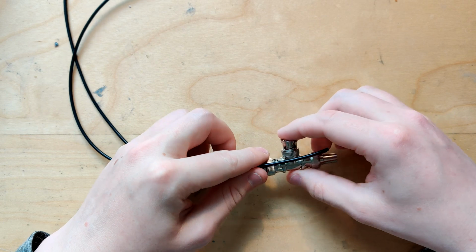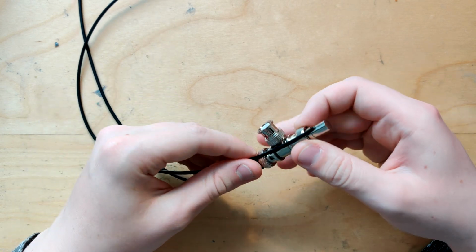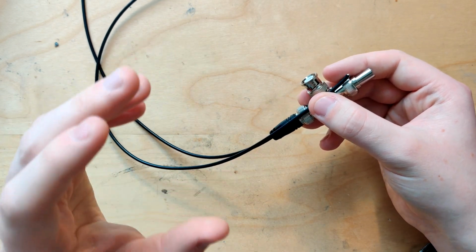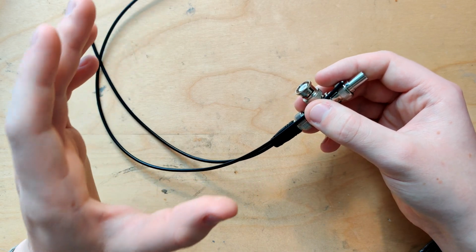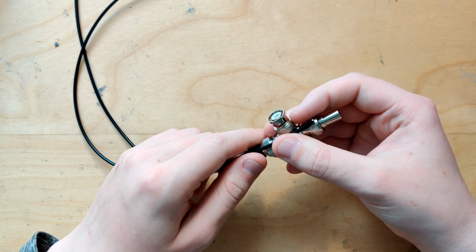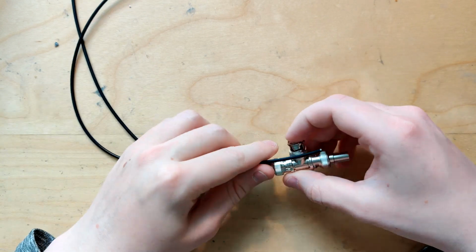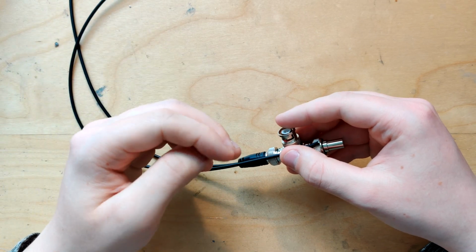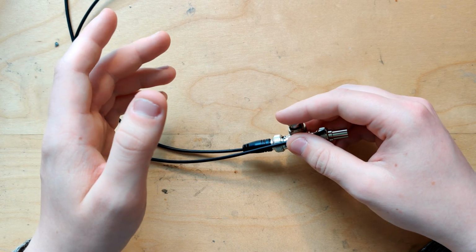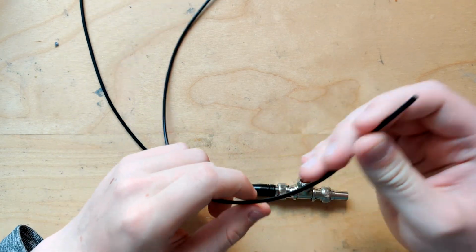You can spend hundreds of euros on high-end oscilloscope probes, and when it comes to accuracy, these ones still have a bit of noise, but it is so little that you can't see it if you look for it, and it's not gonna affect what I'm measuring. So for my purposes, these are perfectly fine. Unlike the other one, which read the voltage high and had huge issues with catching interference. If you just change the angle of the clip slightly, sometimes you would see twice the VPP. It is really bad. But yeah, let's get right into it.